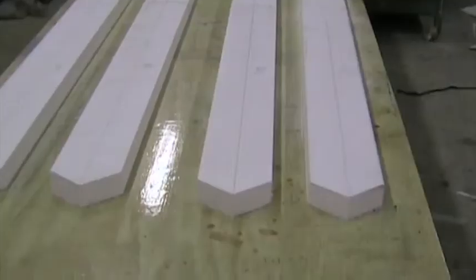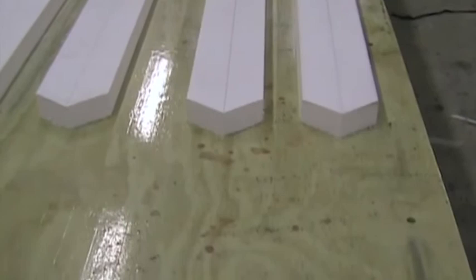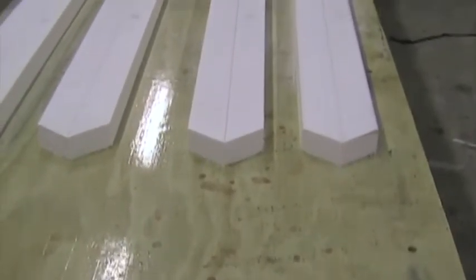Here are the plywood inserts which I'm busy laminating. Seven pieces make up each plywood insert. I put wax paper between every seventh piece to stop that bonding together. And I've got a piece of threaded rod which is passing through a hole which is ultimately the wing pin hole. Once the plywood inserts have been removed and trimmed, they'll be positioned here and attached to the spar foam.